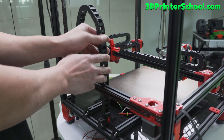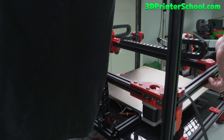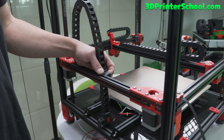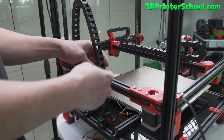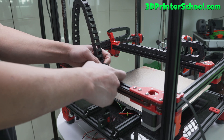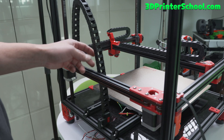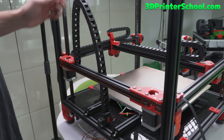Because this FormBot kit comes with chain link that only goes one way, you really don't need to put this extra piece here — it just keeps itself pretty straight. The only thing that little piece does is keep it from falling apart. I'm going to skip this step because it's sort of pointless since this chain only falls one way. You can use an M5 10 T-nut or M5 hammer nut to attach it — it will prevent the chain going this way — but you don't need it if your chain doesn't go that way.